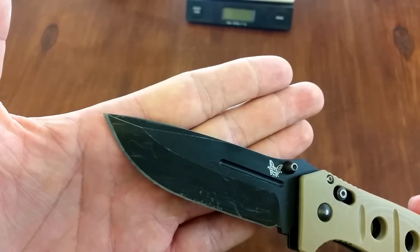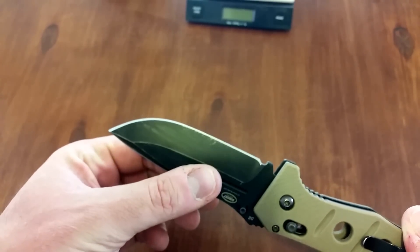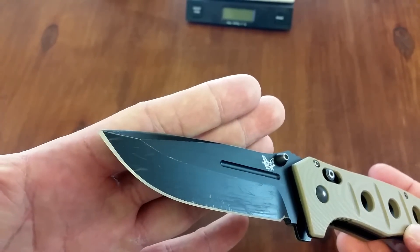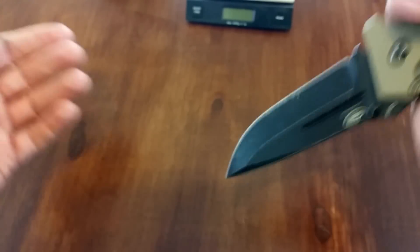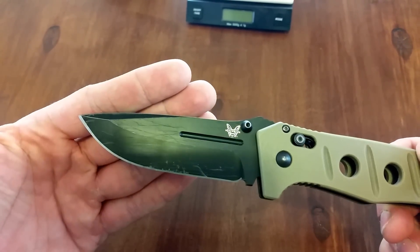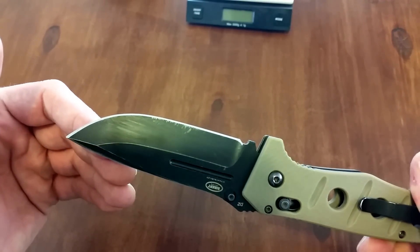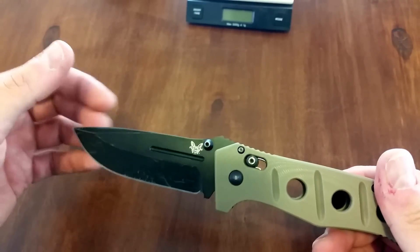There's a little bit of reprofiling just because I'm coming off a factory edge, so the angle — because I'm clamped back here — is always going to be a little more acute. So there is some reprofiling, but I didn't remove a ton of material, especially from the edge. The only lasting damage is on the very tip — there's still a little bit of chipping from the stabbing. I think particularly the chicken wire is what really did it. You can see the coating held up very well. By regular photographs, it would have looked perfectly black, and the Cerakote coating held up phenomenally well. I was very impressed.